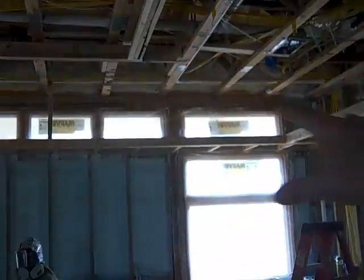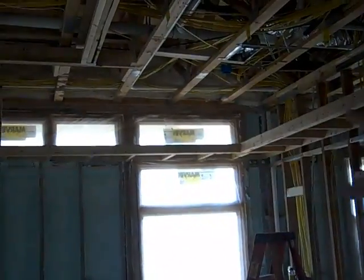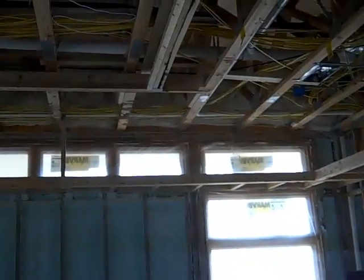These architects do an amazing job with the building science behind the way they build. One other quick thing — where our bays for our trusses are, you can see we've used closed cell foam in those areas. It's really the best product for insulating in that space. We've got 6 inches in those truss bay areas as well.